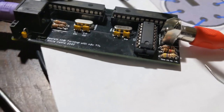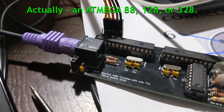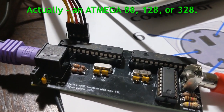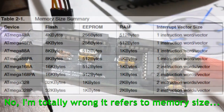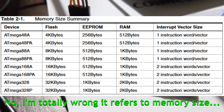And you can use an 88 series for the I/O if you wish, but I believe — I'd have to look at the datasheets — the 88 series uses more power, so the pair of 328s is probably the way to go.